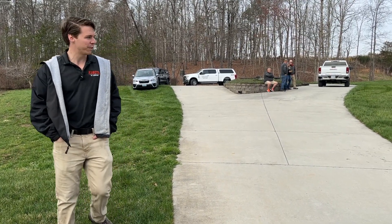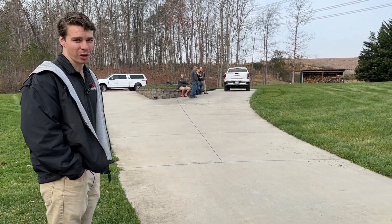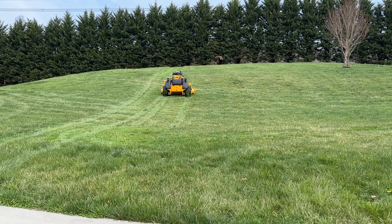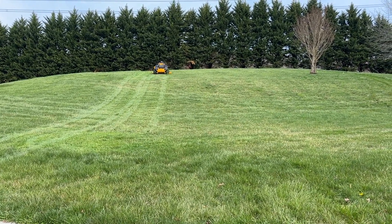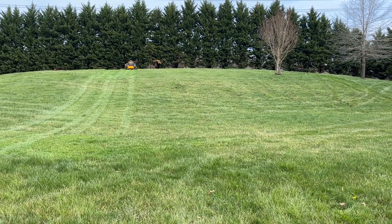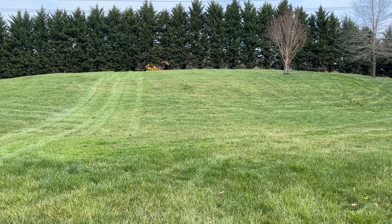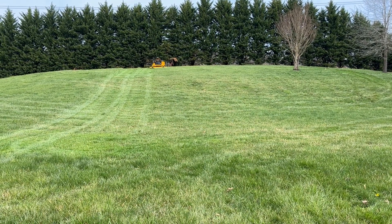I just did my first round. What you do first is that outside pass, then you turn off the PTO. You can actually see the mower behind me — it's revving itself up. What it's going to do now is follow the paths I just made, so it's going to be very efficient, cutting right on the edge of where I hit. They're still working out the fine details — you have to leave about a 10-foot obstacle range. It's going to sense things like trees and obstacles. Right now it's going to start a striping pattern, sense the boundary, and stripe itself.